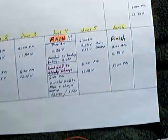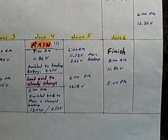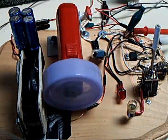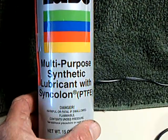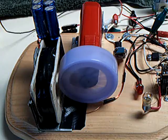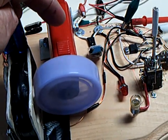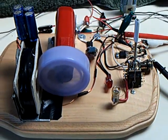It took a couple of days to get this all balanced back up again to where it was when we started. I stopped the motor for a couple of minutes every day and used this super lubricant — a Teflon-based super lubricant on the motor. That little permanent magnet motor has a bronze bushing on the front and a nylon bushing on the back, and using the super lubricant it was able to survive the week.